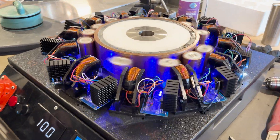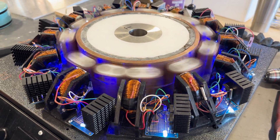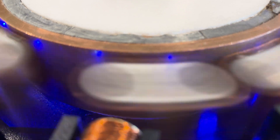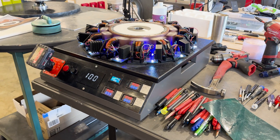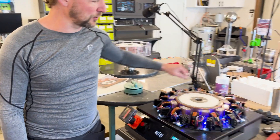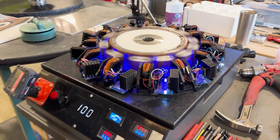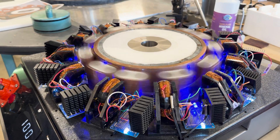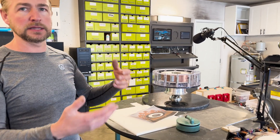With these temperature sensors, one sensor measures the temperature on the core and the other measures the outer temperature. What we believe is happening is that as it's rotating forward, you're having a magnetic oscillation going the opposite way. One of the things I've seen with most of the other replicators is that they mechanically link the rollers all together. We believe the rollers can get hung up because of that. So here the rollers can wobble — they have all this play — and if nothing's locked down, the magnets are doing it to themselves.